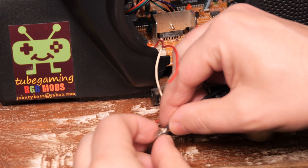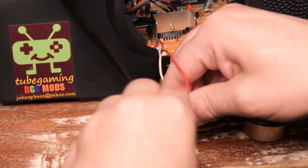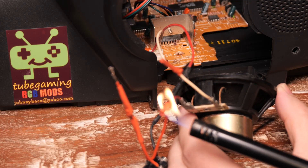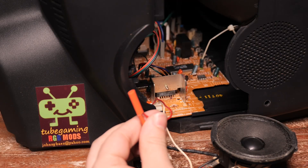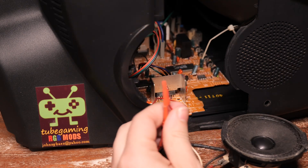Stripping them so that they have plenty of wire exposed. First, I twisted the negative wires of the speaker with the wire that goes to pin one, and I heated up some shrink wrap tubing to hold it together. I did the same for pin three and the positive terminal of the speaker. And finally the other side of the positive wire, twisted together with pin five and pin two.